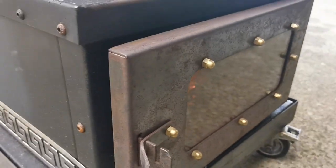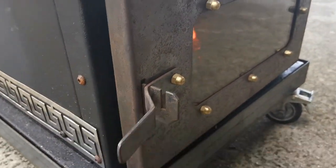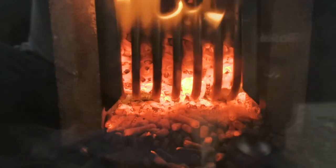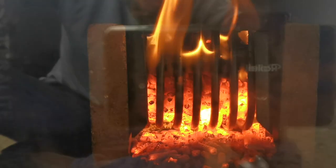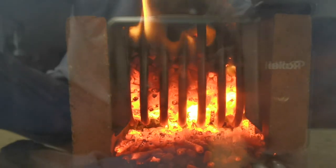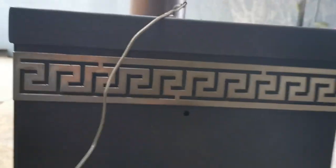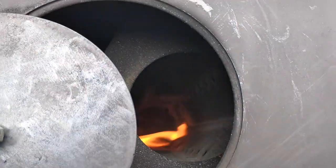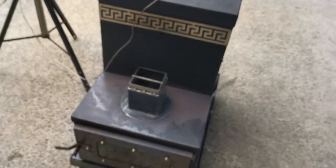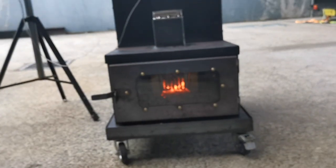Now I've got the door open a crack. I can't actually close that down, so I'm going to just close that and see what happens. It'll create a slower draft across the flame face. It's still getting air from the heat rises, and the air it's going to get will be hotter — it'll be preheated. So it'll take a little while for the whole system to adjust to that. I'll give it five minutes to settle in and then have another look at how it's burning.